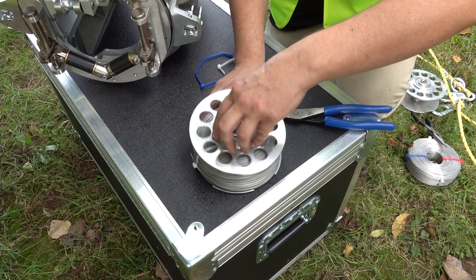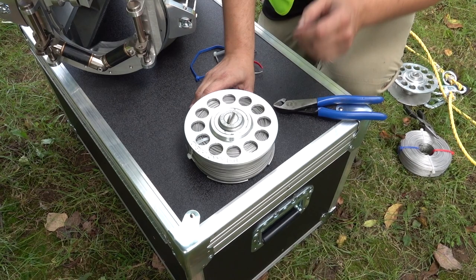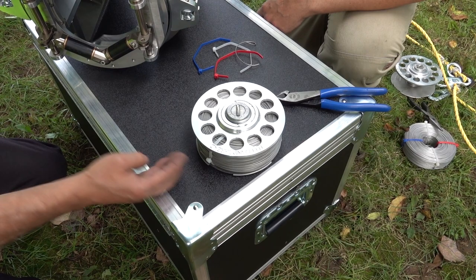I'm just going to put the lid on. Again, it is a left-hand thread. If you put a little bit of tension against the spool — if you over-tighten it, you will not be able to get the buckle out of the unit.